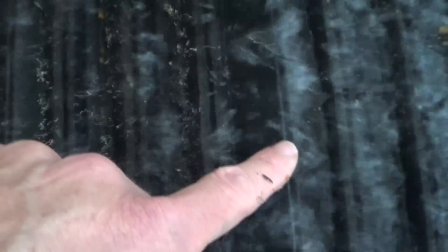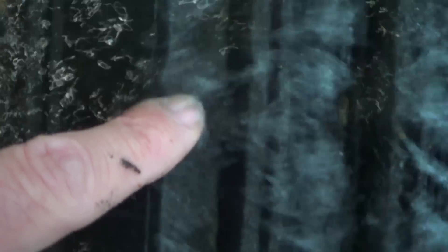It gets really clean up at the top, then it starts to slow down and fill up more, and I have more black sand down here. This mat looks like it's empty, but it's actually full of black sand — that's from some of that Oregon beach sand. So where's the gold going to go? It's going to be hard for it to get into a fully packed groove. That's why I like the fact that this first one might be totally full, but look at the next — less full, then less full again. As it goes down it's going to find a spot to hide. Let me go ahead and shut it down.